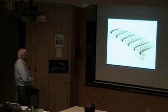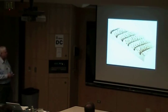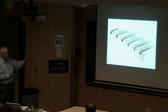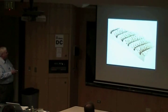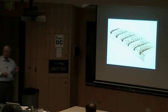Now this is an artist's view of what that focus screen looks like close up. It's a Fresnel type surface with a bunch of sloped facets. Now those are 5/1000ths of an inch wide. And in order to make the texture look good and not like gravel on your driveway, we have to keep the irregularities that are put on there down to about 1/1000th of an inch across.